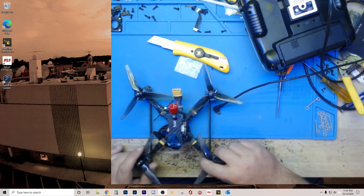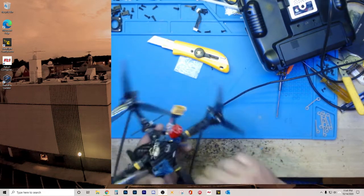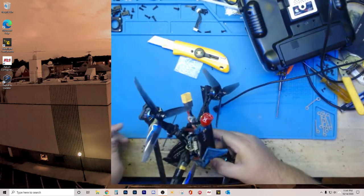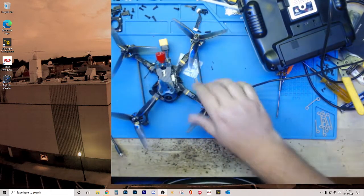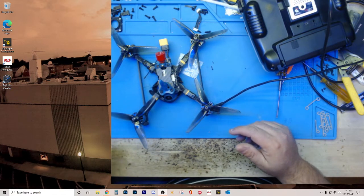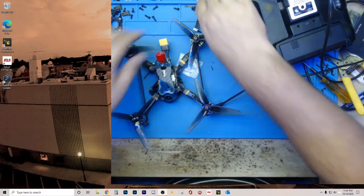This is going to be super quick. If you haven't seen the other video, the gist of it is: if you want to get pass-through to work, you need to plug in the XT60 before you plug in your USB. But tonight, I thought I was going to have to delete that other video because I started having a ton of issues with getting BL Heli pass-through to work on my quads. I couldn't get it to work on any of them, and I was literally losing my mind — I was doing everything right.